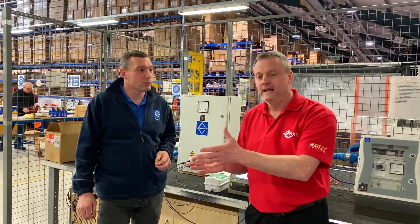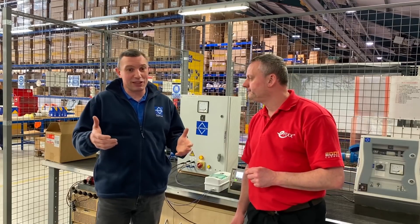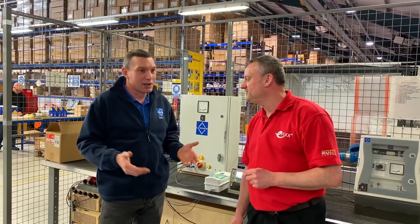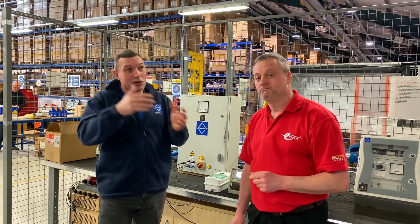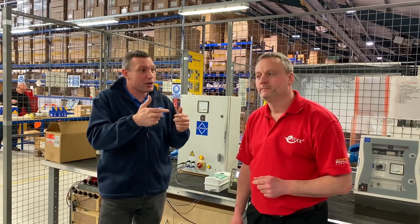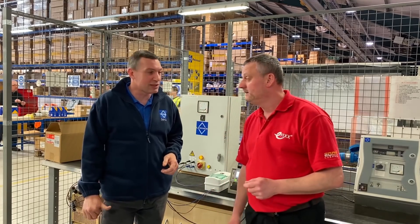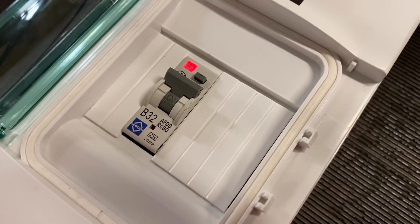What if I've plugged in my hairdryer — creating sparks — but the circuit also has a series arc in the fixed wiring? Two things are going on. The AFDD is looking at the hairdryer and ignoring its normal sparking operation — it's immune to tripping under that normal device operation. But it still has to see and respond to the arcing fault occurring in the fixed wiring. Under those circumstances, it would trip and disconnect the circuit — even with both happening simultaneously. That's a really clever bit of kit.